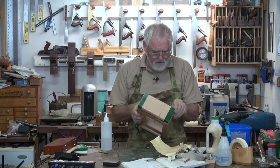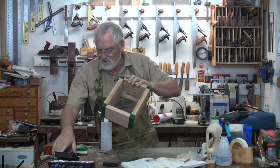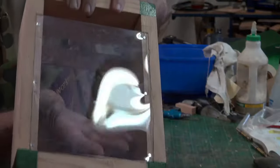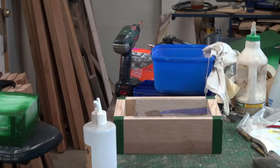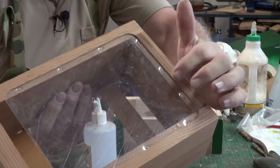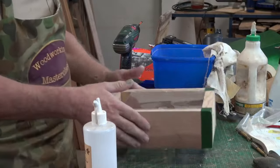In the book that Tim wrote and the one we just made, the major difference between mine and that is if you look on that inspection plate or viewing platform, it goes to the end, which there's a bit of a gap there. You can see that poking up. Now the bees will eventually fill that, but you can also run into a bit of problems with water getting in there if you get sort of horizontal rain. Whereas the one I do, which you saw me do then on the router, I actually bring it back so it's sealed on the timber. The bees will still come in here and fill that up, but it waterproofs it a fair amount. So that's something you might want to consider.